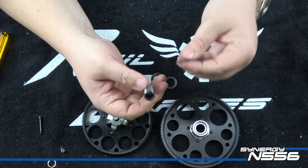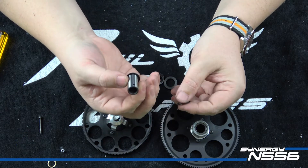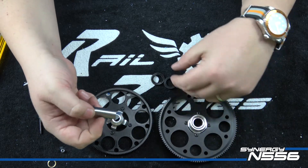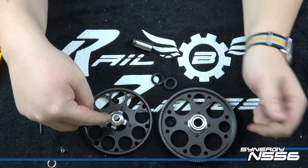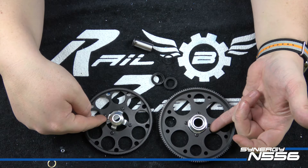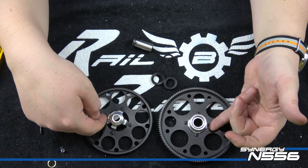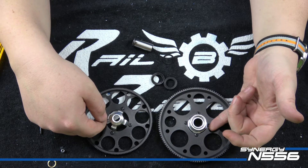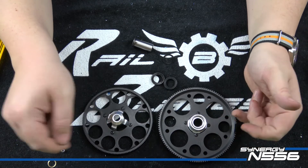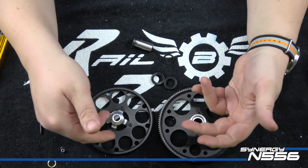The sleeve itself is pretty straightforward. You also have two small Delrin shims - one goes on the column on the sleeve, the other goes between the one-way bearing and the auto rotation hub. Both the auto gear and the main gear have four 2.5mm screws that we need to remove, loctite, and reinstall. Make sure when reinstalling these you don't over-torque them - there is absolutely zero reason to torque these down tight as you can crack the Delrin. Snug them up and let the loctite do its job.